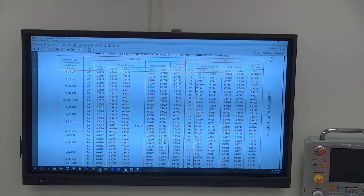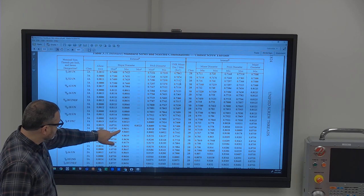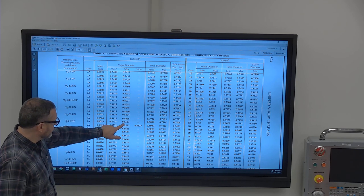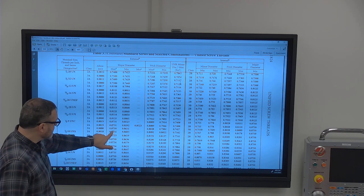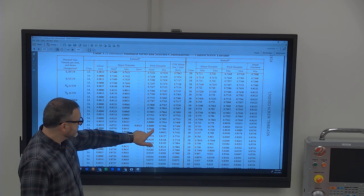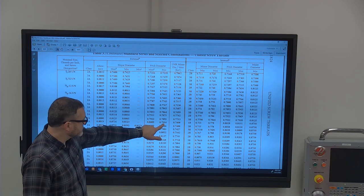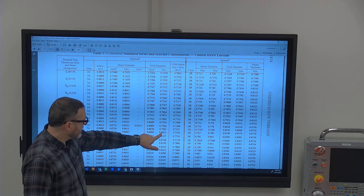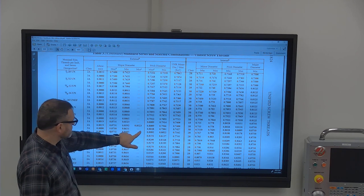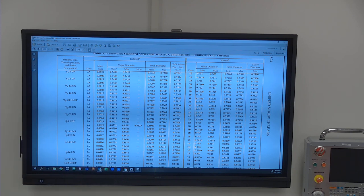What's the difference in your classes? Okay, it's a great question. Your class of fit just determines the tolerance. If you look at 7/8-9, you get less tolerance as you go. Here you get .873 to .852. Now you get .875 to .861. Then .802, .798, and then .800. So you have almost nine thousandths here, and you have about six thousandths, three to four thousandths there. As the number gets higher, 1, 2, 3, the tolerance gets tighter.